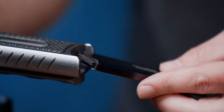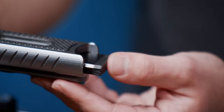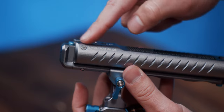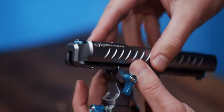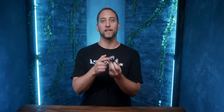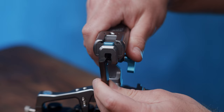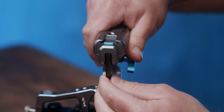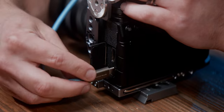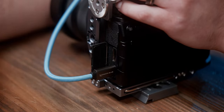Once you have your drive picked up, you just insert it face-up into the back of the handle until it clicks into place. Underneath the machined aluminum, there's an interface that converts SanDisk's proprietary NVMe connection into USB-C, hidden just inside this NATO rail in the front. This works perfectly with our included right-angle USB-C cables and provides some natural protection. From there, you just plug the other side of the cable into your camera's USB port, and you're ready to record.